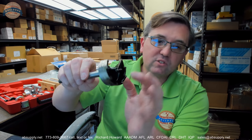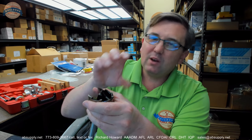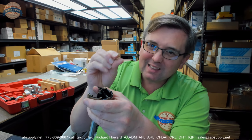The client couldn't have been more gracious. All we did was add some scar plates, some Don-Jo scar plates, and it was fine. But I do not like these aggressive outside cutters. When you use a bimetal hole saw, you have tiny little teeth. You can't really rip that veneer. And plus, when you get that going, you go nice and slow so that you're really scoring the door first.